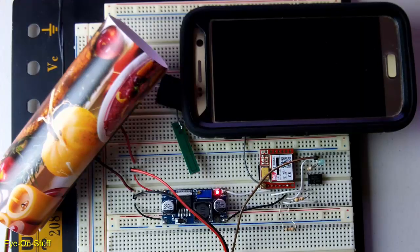My alarm system is powered on. I made a cardboard tube and put the PIR motion sensor in the tube so I don't trigger the alarm. The LED is blinking, meaning it is armed. The LED on the SIM800L GSM module is blinking every 3 seconds, meaning it has a cellular connection. I'll go ahead and wave my hand over the sensor to see if it triggers the alarm. The green LED should turn solid green, sending me an SMS message.